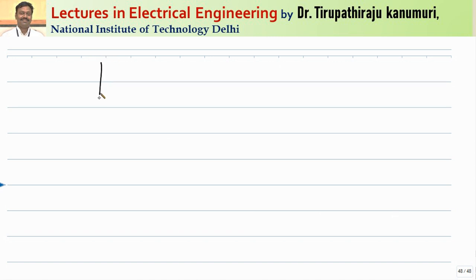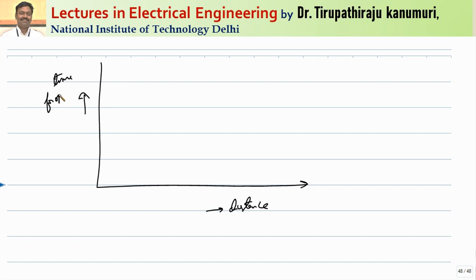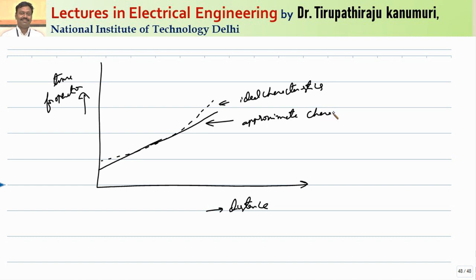Practically we can get the characteristics of distance versus time for operation. The ideal characteristics are exponential, but by properly adjusting the tension in the spring and other parameters, we can adjust these characteristics to resemble something linear — these are the approximate characteristics. Because the relay will not operate until current reaches some setting, we can get a minimum operating time for the relay, which will generally be set as 0.2 seconds for the case of the induction type impedance relay.